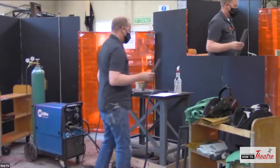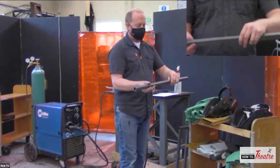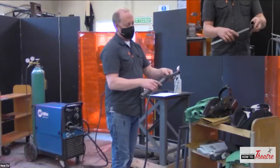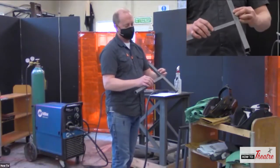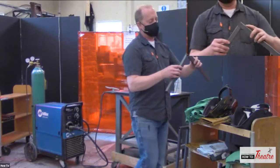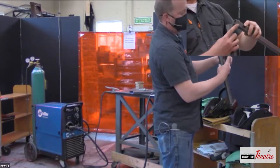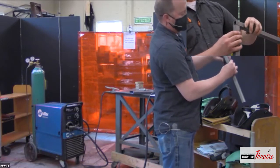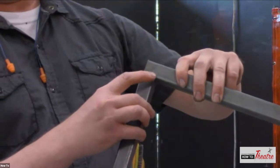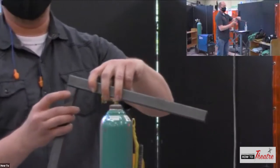So spot welds are very handy. Just a butt weld, when you just want to weld two pieces together. A lot of times what we're doing is T-welds, T-joints, something like that. We're at the corner. With these, you have to be careful because you've got more steel on this side rather than there because you've got this nice strong corner. So when you're welding, you have to stay over on this side and slowly join this together. Otherwise, you'll melt through the thinner side quicker.